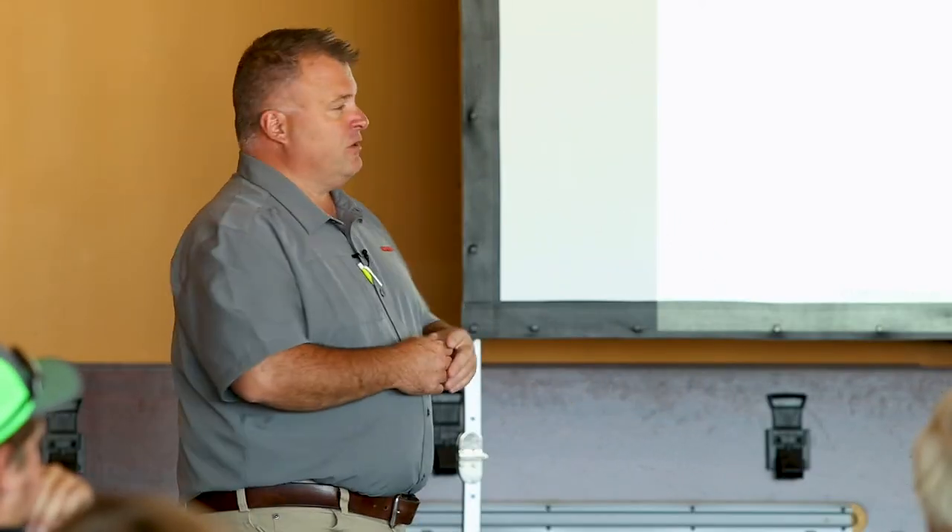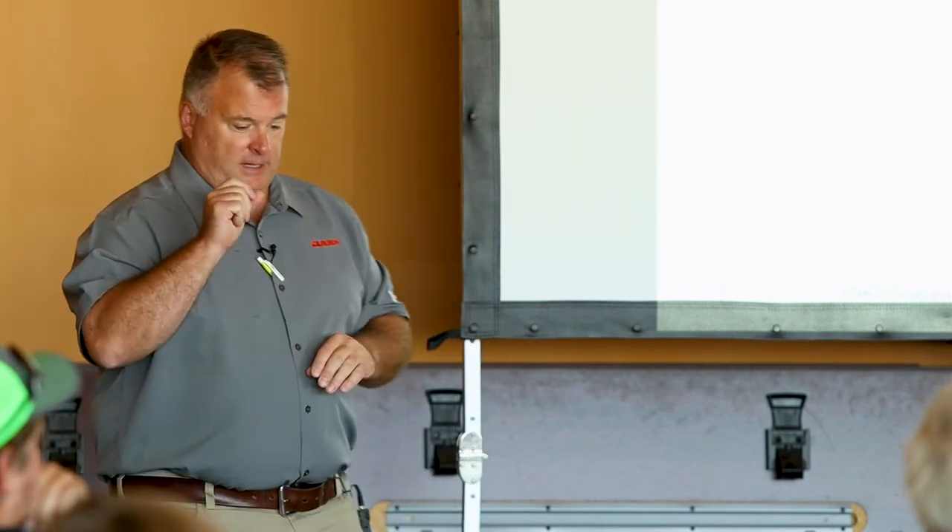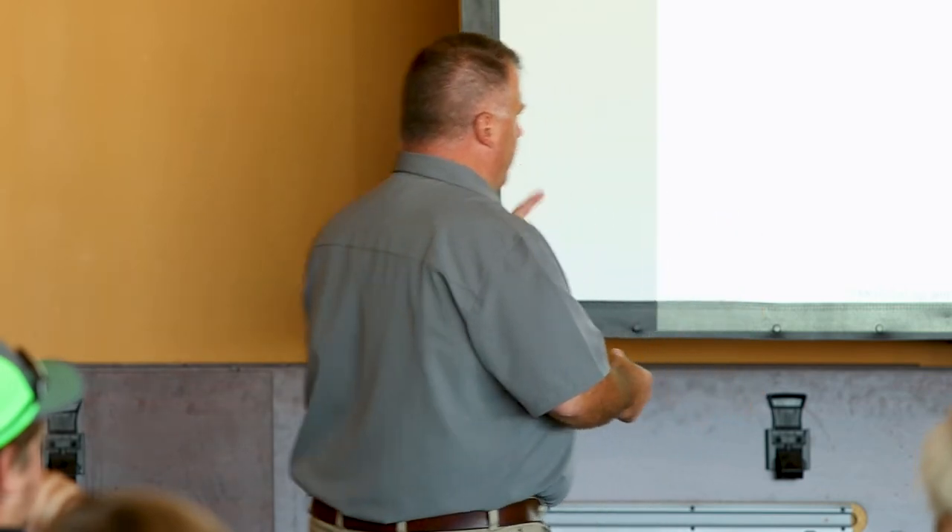The zero cal is when you're just sitting out in the lot with the header on and the combine at max no-load — all processor and feeder house engaged, no crop going in. Then go to the very bottom where it says zero throughput, hit the bar and calibrate for zero flow. Then once you get into the field, do it one more time. Get about 50 to 60 yards in the field, get the combine full, then push and hold your automatic button — also the autopilot button on the joystick — for three seconds until it beeps. Then it calibrates that roller to full flow.